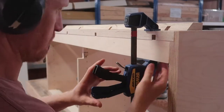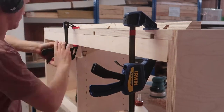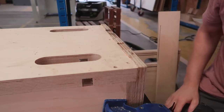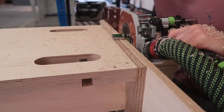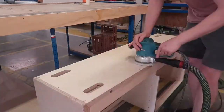To glue the top cleat into place I used clamps and then added a couple of screws from the top just to keep it secure until it dried. I intentionally left the vertical sides slightly proud - now that the unit was glued up I used a router to cut it flush to the top and then gave the completed unit a good sanding to 240 grit.